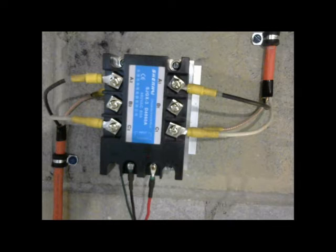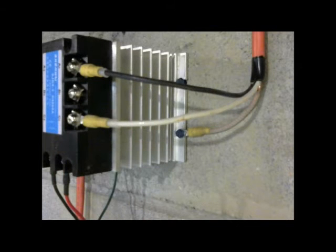It's good to have twice the capacity with your solid-state relay compared to what you'll need. When you operate these relays, heat is generated within — that's why they're on a heat sink, and they get quite hot if you push their capacity. I purchased this relay off of eBay from China for $34 delivered; if you tried to buy it from a US manufacturer you'd pay five times that. This relay was recommended by some helpful folks at DIYchatroom.com forums — I highly recommend you check them out for technical assistance. A standard-size aluminum heat sink is used for three-phase relays, with thermal compound between the heat sink and the solid-state relay to help with heat dissipation.